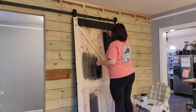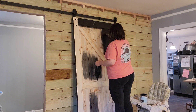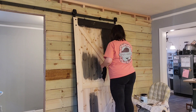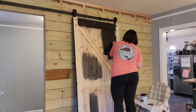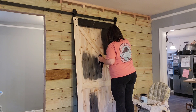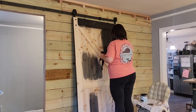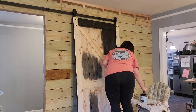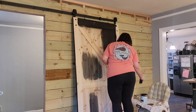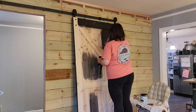What I would do is paint on a section, wait just a few seconds. The can says to wipe it off either immediately or within two minutes — so between zero and two minutes. I wanted more pigment, but where I had tested it before, it was much lighter than I wanted. So I started waiting longer before wiping, and that's also when my cloth was dry before. Just wanted to show you guys getting this done.